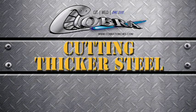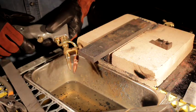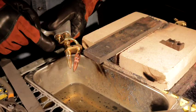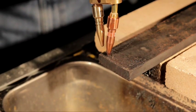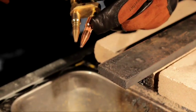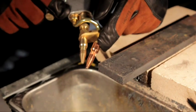We're getting ready to cut thicker metal — normally from about a quarter inch. You can push with the undercutter as we just showed you, but usually from about a quarter inch up to one inch, the overcutter comes out over the top. Heat with the number two, put your copper tip on, keep that copper tip straight up and down, right down close to the metal. Remember, the closer to the metal on your cutting tip, the nicer, thinner, finer, cleaner cut you're going to get. On all thick metal, we have to preheat.